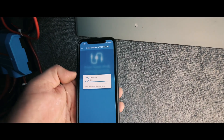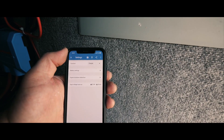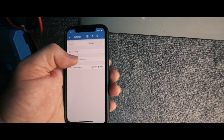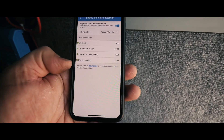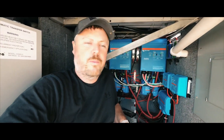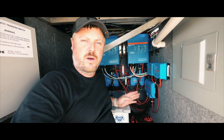I can click into this — here's what it looks like when you open it up. What I had to do is go up to the settings and change the function from power supply to charger, so it's just going to charge the batteries. And this thing is awesome, guys — no solenoids needed. You can go to your battery settings right here. It has all your battery settings, engine shutdown detection already set up, with the start voltage, delayed start voltage, delayed start voltage delay, and the shutdown voltage. Once these recognize that the bus is shut down at 27 volts, it will shut the chargers off. Really cool — this is all you need to charge your house batteries connected to your start batteries. They're all automatic, no solenoids or anything like that needed.